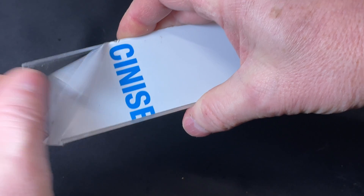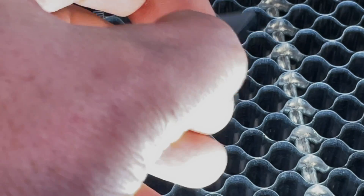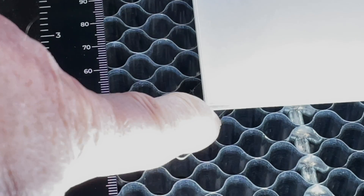The acrylic I use has white film on one side and a translucent film on the other. I'm going to engrave on the white side because it's absorbent enough for diode light to cut the film without going through to the other side. The semi-transparent film on the other side can react if the acrylic is laid directly on a honeycomb — the beam hits the honeycomb, heats up, and mars the back surface. To solve this, I lift the acrylic slightly using the small magnets that came with the X-Tool S1 honeycomb underneath it.